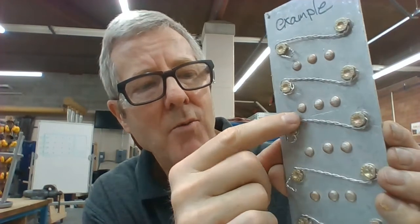An example of where this is used: the wings of an airplane may be fabricated in one factory while they're working on the fuselage in a different factory. When they bring the wings in to join them onto the fuselage, they'll use safety wire on these bolts all throughout to hold the wing in place. If they ever have to take the wing off for maintenance, they can just cut those wires and then put them back on.